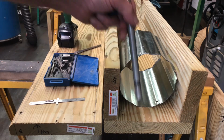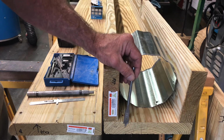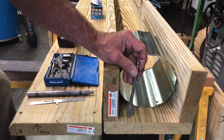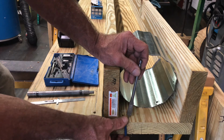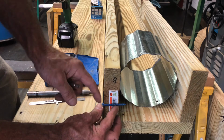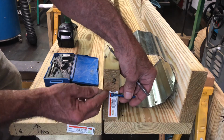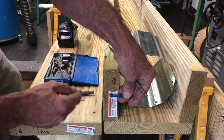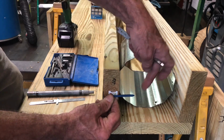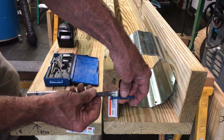in the masonry. So I'm going to go ahead and do my layout down the line. And again, one of the reasons that I'm pocketing these screws is they don't need to sit flush below the surface because there's enough room in here around the radius of that tube that's going to be contained in there. But I do want more of these threads. You can see that right now I've only got about 3/4 of an inch of threads that would be presenting itself into that masonry wall. So I want to counterbore this enough that I'm not exceeding half of the thickness of the cross-section of my material, but the smooth shank will be engaging the material, and all of these threads will be engaging my masonry because I'm going to create that pocket for this to sit down into.